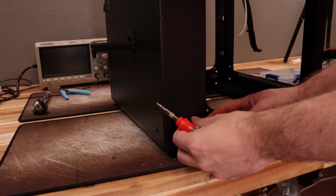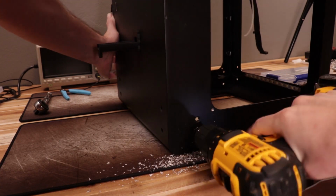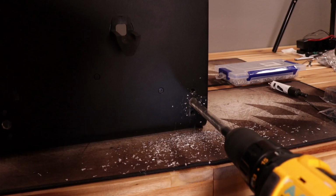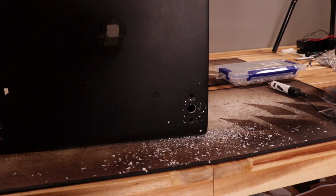The drill guide will help give a center point to make a starter hole. Then we remove the guide and drill a bigger hole. The rods are 8mm, so I went a little bit bigger and used a 1/2 inch drill bit, so I had some wiggle room in case the hole wasn't perfectly centered. I'm sure there's better tools for this, but this does the job just fine.